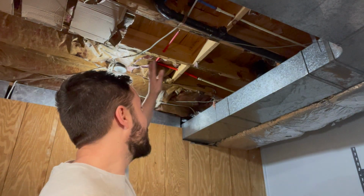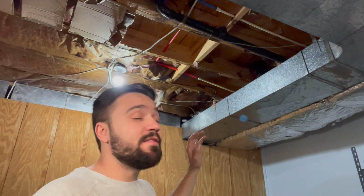I know not every project's the same, but if you find yourself in this situation, I hope this video provides you some guidance. One last tip for you. Whatever type of conduit you have in your house, when switching to PEX, make sure to use the proper transition. Don't attempt making up your own transition. That's just a recipe for future leaks.